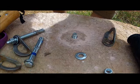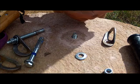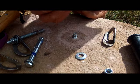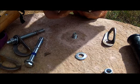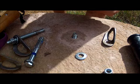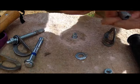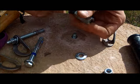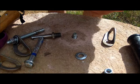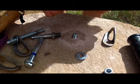Our spinner tool is this tool right here, which is just a standard coupler nut — a three-eighths coupler nut from a hardware store — but one side has been drilled out to a half inch to fit an SDS adapter tool, which you can buy off eBay, made so you can put a standard drill chuck on there and attach it to your rock drill. Matt Reeser designed this with a little set screw on the interior so that you can make sure it doesn't go too deep.